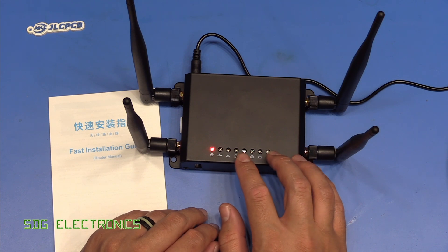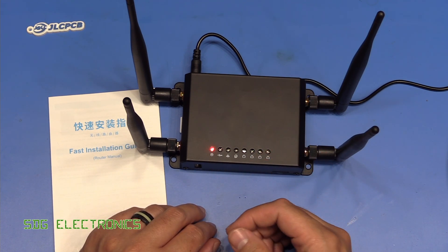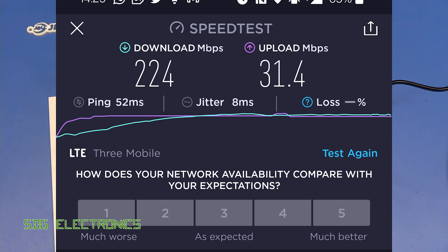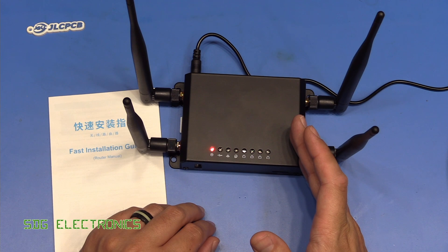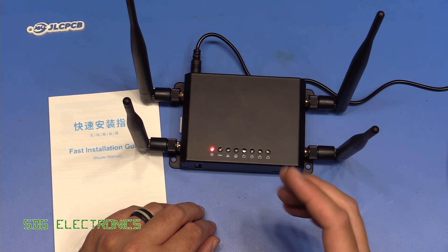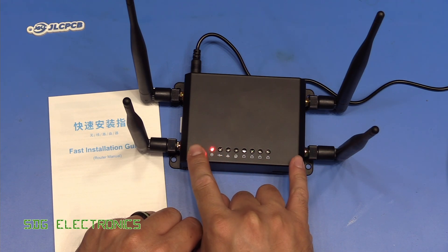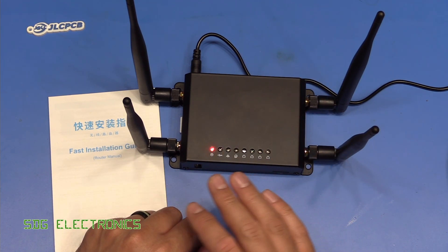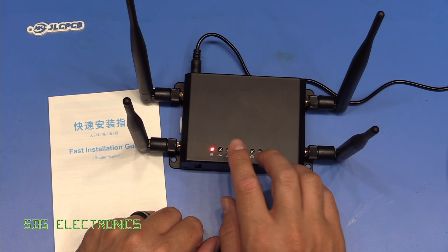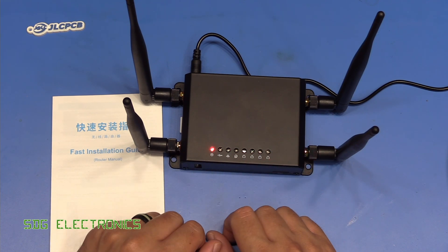As a reference point, my mobile phone — a much more capable device — got 224 Mbps download and 31.4 Mbps up at the first location, and 102 Mbps down and 43.9 Mbps up at the other location. I think the difference is partly the modem, and possibly the network detects whether a mobile phone or a dedicated modem is connected. When tethering from my phone to a laptop, you do get those speeds in bursts but then it drops down to something more like what you get from this router, so there's some traffic balancing happening on the mobile phone masts.